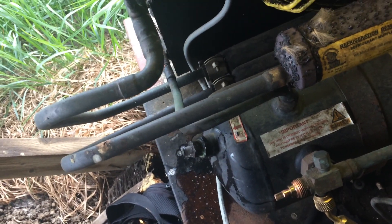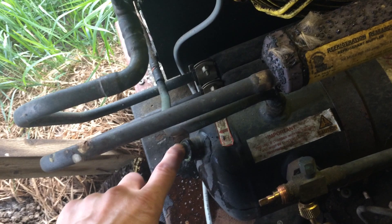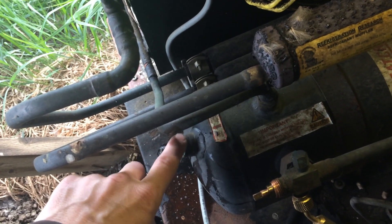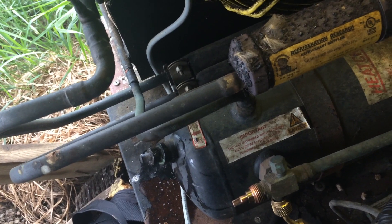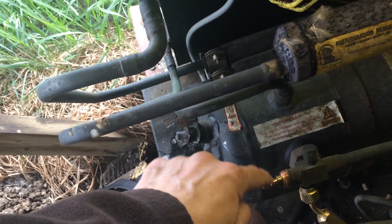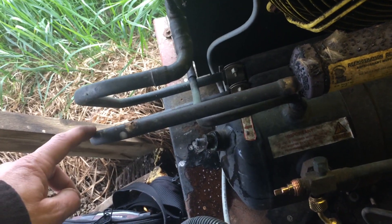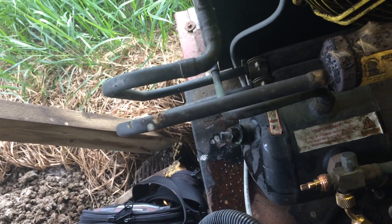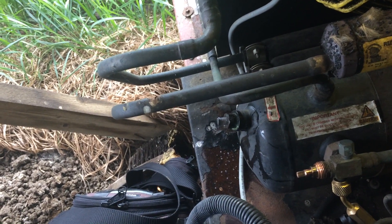It's on R22, so we've got to convert it to something else. I think I'll put a new plug in there, put some nitrogen in, and make sure the rest of the system is leak tight, and see what we've got on the van. I don't know if I've got enough 407F to do this, because I used a load the other day and haven't been to the wholesaler since. The van's been off the road — the prop shaft went wrong — it's been off the road most of the week.